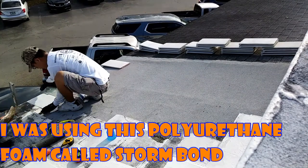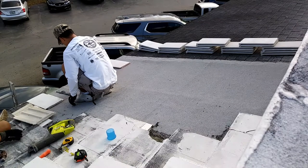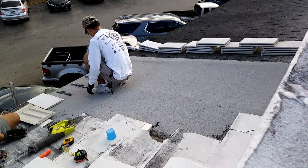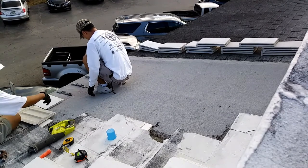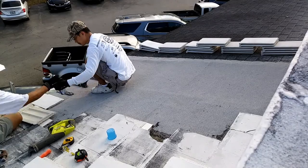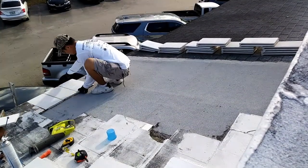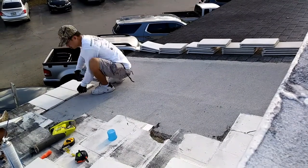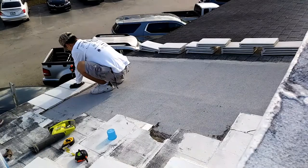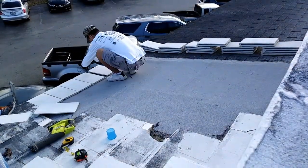What I'm trying to demonstrate here is that most of your waterproofing for your roof is not from the tile or from the shingles — it's actually from the waterproofing layer that I'm standing on. Either some people have the 90-pound felt or the Tyvek plastic sheeting. What we have is some sort of EPDM elastomer composite kind of thing.